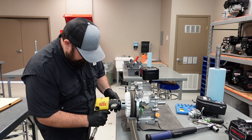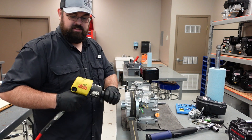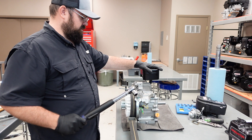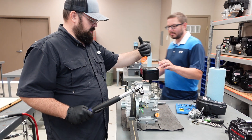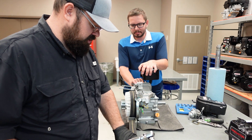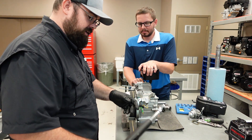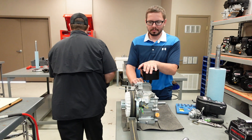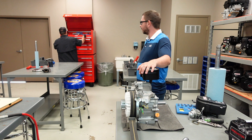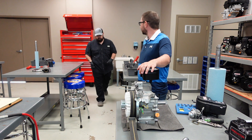Make sure you're going clockwise. I'm just going to seat it gently, and then I'm going to have Mr. Lucas come over here and help hold. You'll need your lab partner to help pull down to the table. Your strap wrench should be jammed against the bottom of the table, and you'll need an extension — a three-inch extension.